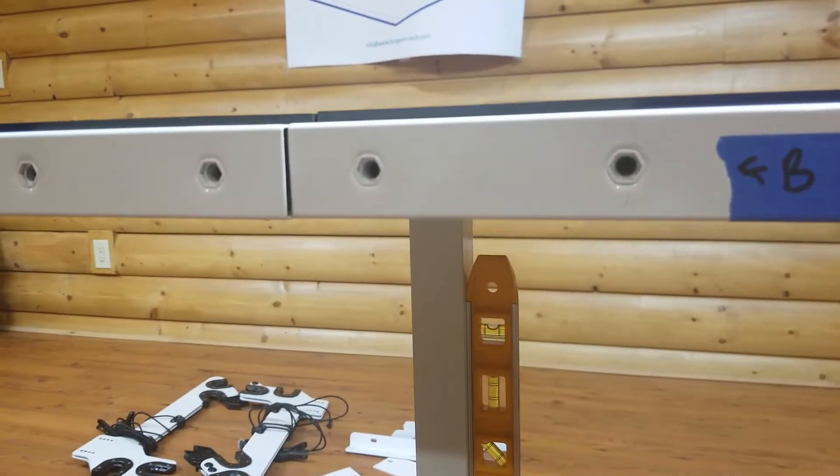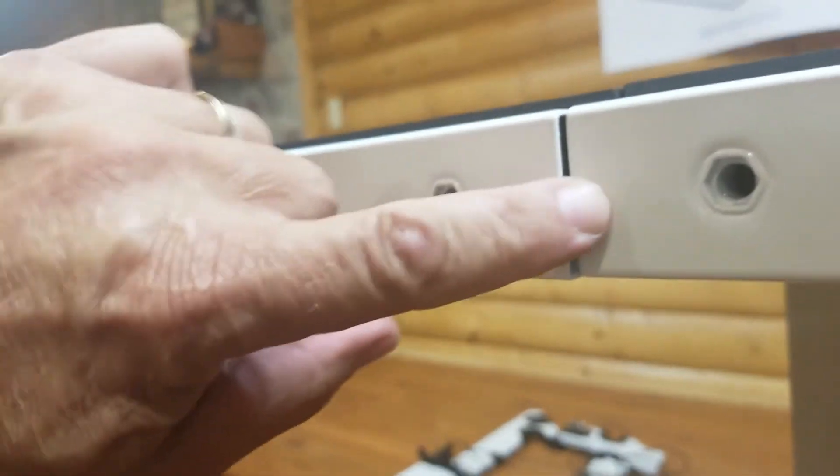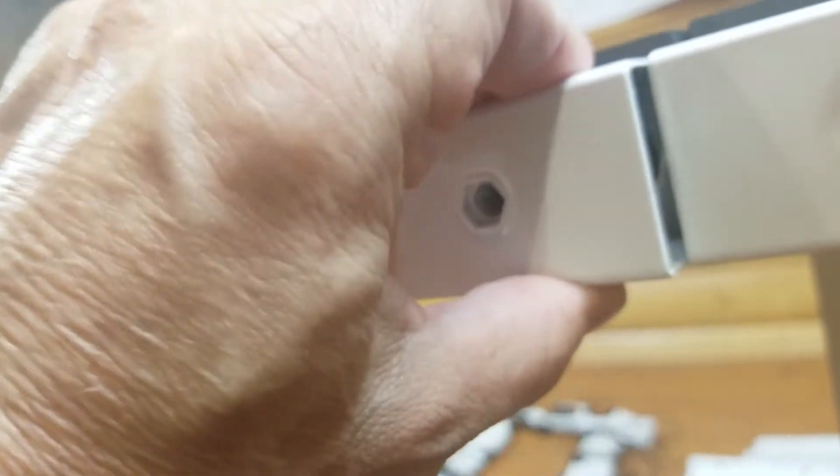You can see we've got a pretty big gap here even though we're pretty close to level at the top. You may have noticed that the fasteners have a much bigger hole than their shaft needs, and that lets you slide the top sections left, right, up, and down to be able to optimize alignment. Left and right is much easier because you have the channel for it to lay in. If you're going to have to move it up and down, it'll rely on just the torque of the fastener to hold it and it's likely to shift over time — we'll have techniques to show you how to improve that in the intermediate video.